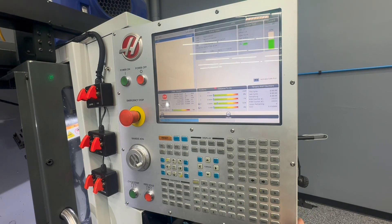Type M19 R0.0, hit Enter to input that into MDI, and hit Start. The drive dogs should not move if this is done correctly, because you always do a tool change on an umbrella style tool changer or a side mount style tool changer in the R0 position. On an umbrella style tool changer your drive dogs should be left to right, and on a side mount they should be front to back.